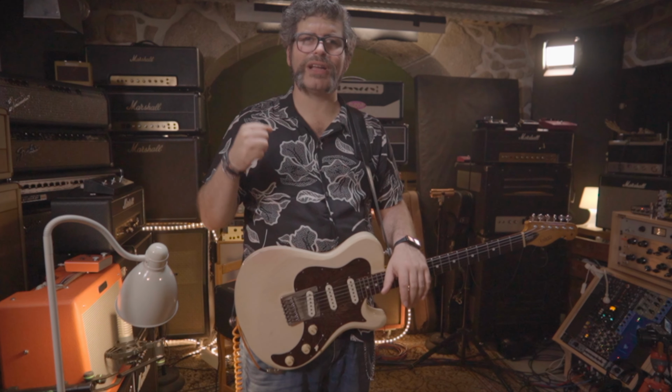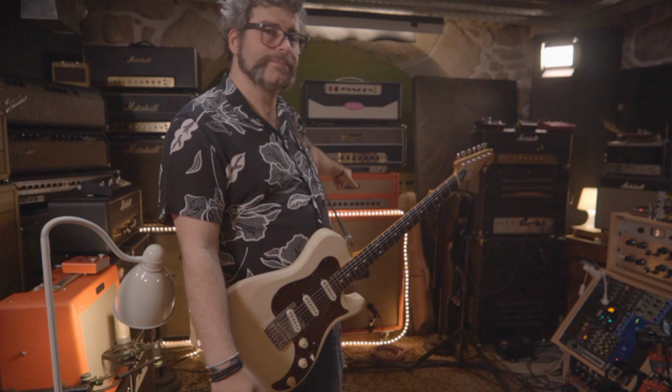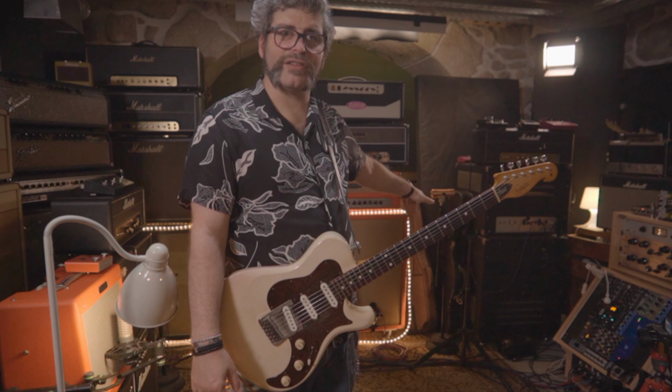But the main thing about this episode is to show you the difference a tube in the power section makes. So when you're thinking about getting an amp, think of the feel you want from that amp. A 6L6 is a very punchy, almost undistorted tube, so if you want clean headroom, that will give you clean headroom. For example, the Royal Atlantic has 6L6 tubes in it, which makes it a little less midrangey, and you get the punch of the 6L6, then you get all the distortion from the preamp section.